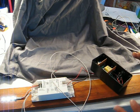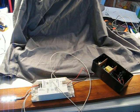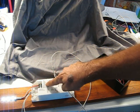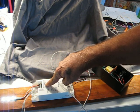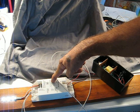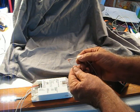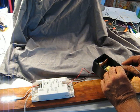And this would be a good idea if you're putting in a large system of these, because these would be just fantastic for residential. Each of these outputs is rated at 5 amps. I wouldn't put more than 4 on them, but still, each one of these 3 outputs on this DALI 6003 module will be able to produce approximately 50 watts, or control 50 watts of LED lighting strip, and that's a lot. That is a lot of LED lighting strip.